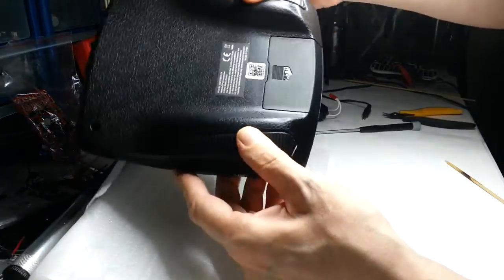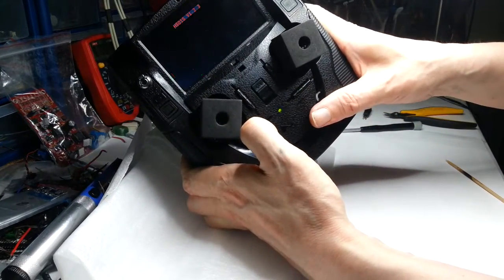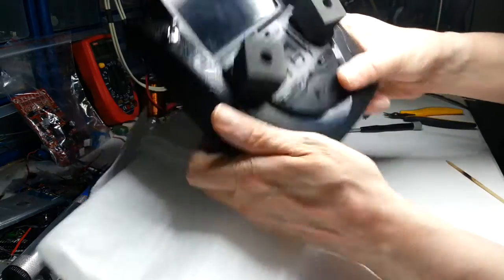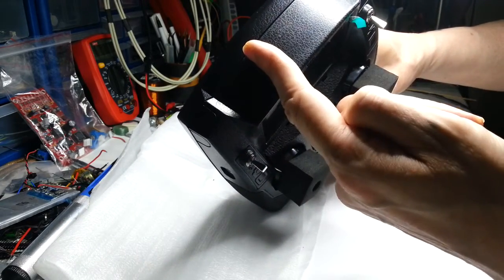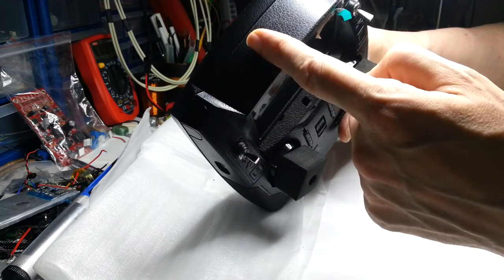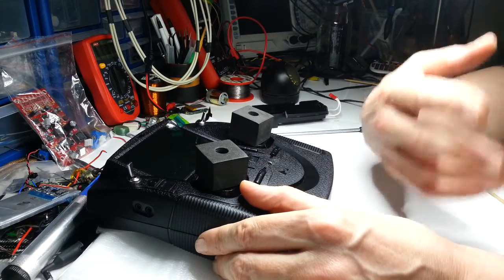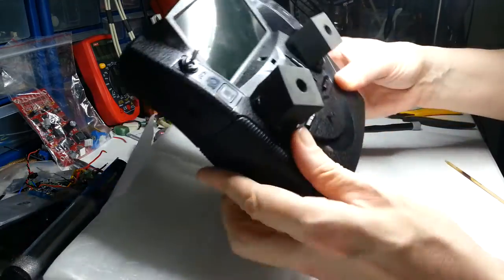There we go. And if I screw all that down, that's good. We've plenty of extra power. See, I was just thinking about putting the toggle switch up here, so I got two batteries on, or one battery. Which then meant when I charge them both, I'm going to switch onto one battery. So I've got two separate chargers. But of course, I'd have to do that with proper isolation, positive and negative, disconnected from each other. And that's the way I'd be wanting to do it.